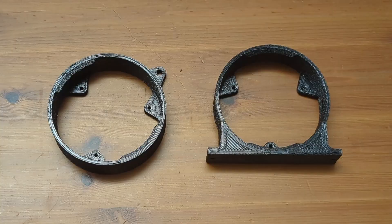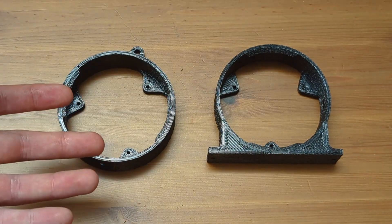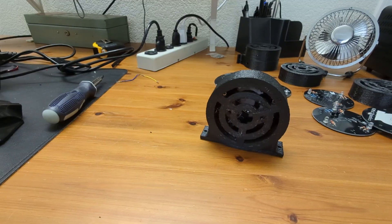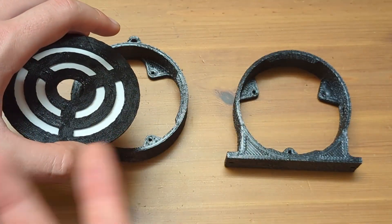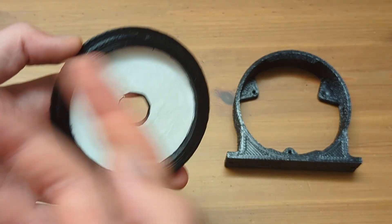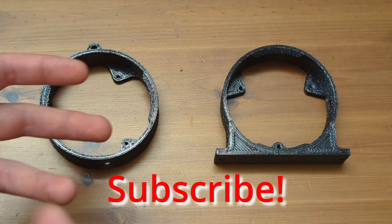I designed the laser gun target housings in much the same way, except I didn't need a backplane since everything is mounted on one singular PCB. I have two styles: one meant to be hung off a wall with a push pin, and one for floor or table mounting that sits flat on a ledge. They have the same snap-on lid mechanism, but with curved triangular bits instead of flat ones. I also added a paper diffuser to better show the color of the LEDs. I actually designed these enclosures on a live stream, so subscribe to follow any future live streams.